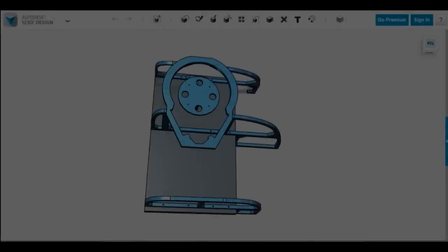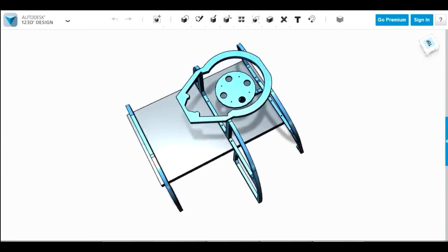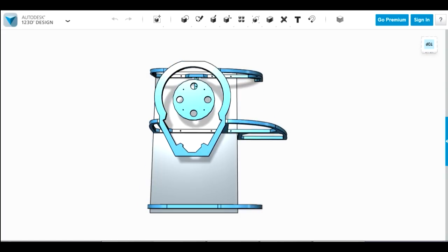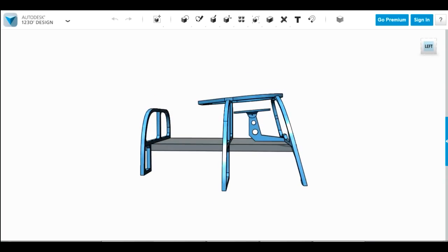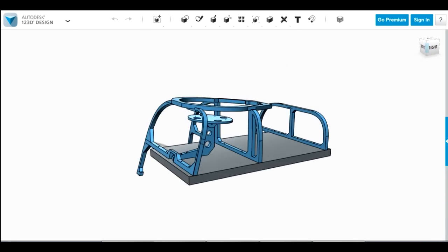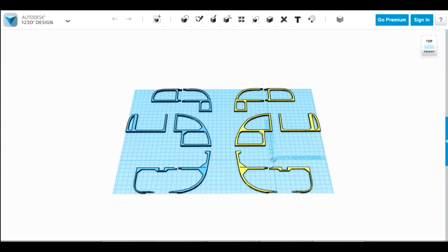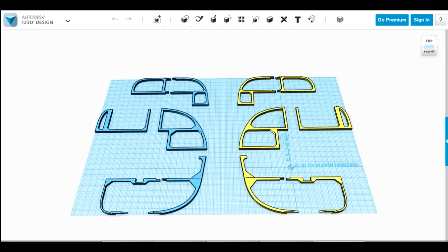Let's have a look at some CAD. The big grey slab is basically the wooden structure of the leg, made approximately the right shape in CAD, and then I've got the calf structure — you can see it sticks out more on the right-hand side. This is the Hulkbuster's left leg. The top piece of the uni-beam support is at an angle, pointing backwards and upwards towards the knee, and there'll be one more piece above that. These parts are split up into full bed prints — something like six or more — and they'll be acetone-welded back together.